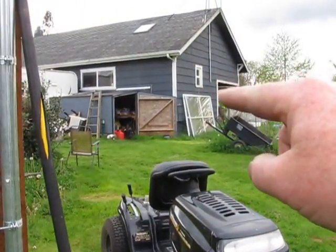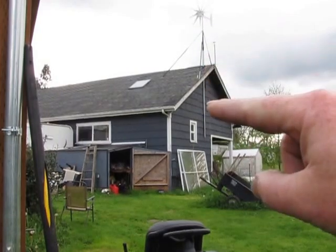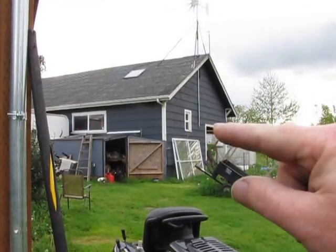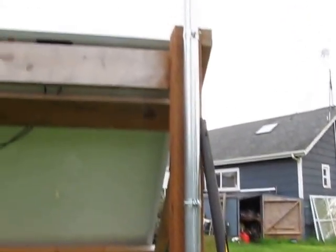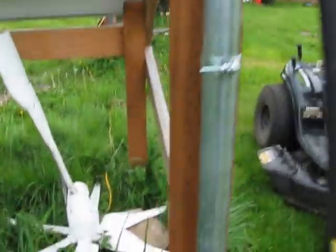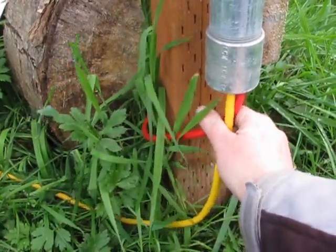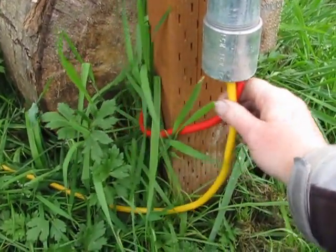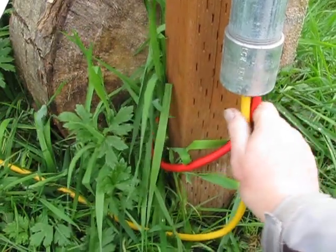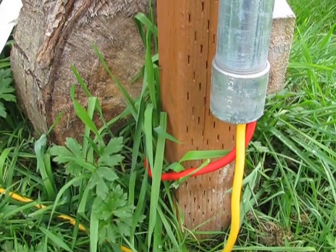You can see the pole stops about ten feet up off the ground — I got two ten-foot poles on that, and I could go up a lot higher. I might go higher with it also. At the bottom of it, I'm going to put the slip ring — a six wire slip ring for this turbine, because it's the Freedom 2. I'll put a box down here and have a six wire slip ring hooked onto the box, with the wires coming down and hooking onto it. So if the wires start getting a little bit tangled, it'll twist the top of the slip ring, and then I can easily replace that slip ring when it burns out.